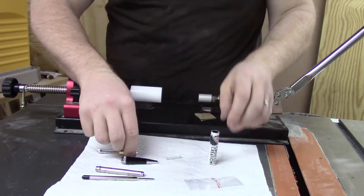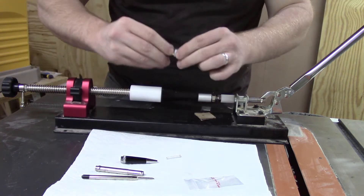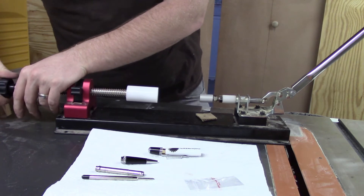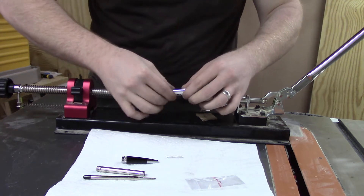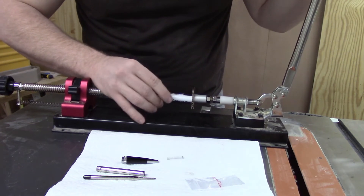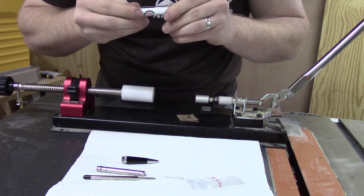With this being a Wall Street 2 kit, I press in the cap of the pen. The nice thing about label casts is that they already tell you where your clip is going to go — there's no decision that needs to be made because the clip hides the seam of the label really, really well. All we do is push the clip into the back of the pen, check the fit, make sure that everything is good to go, and then we can finish assembling the pen.